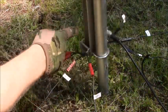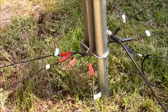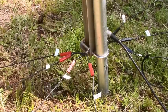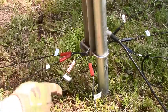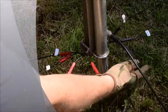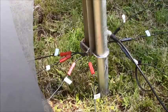And now there are all the radials hooked back up. Somebody walks along and trips on one — oops — just go back in here, plug it in, and continue the mission. You've got 10 meters running black and red opposite each other, 20, 40, 80/75-80 — right there. The other thing you can do is take these velcro straps, attach them to the radials themselves, so when you go to roll everything back up you don't lose them.